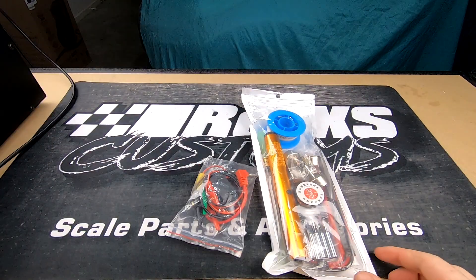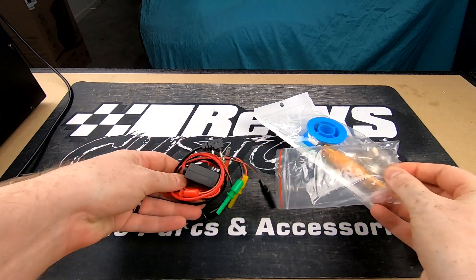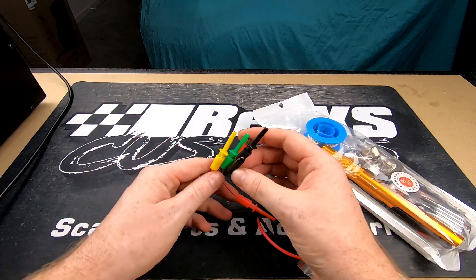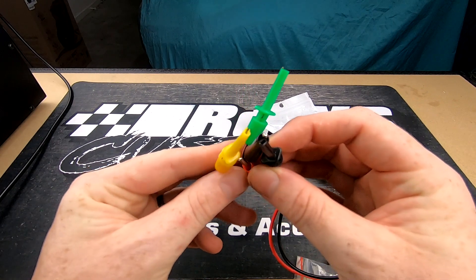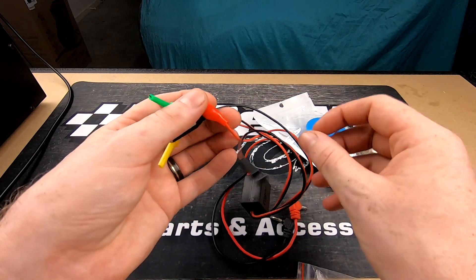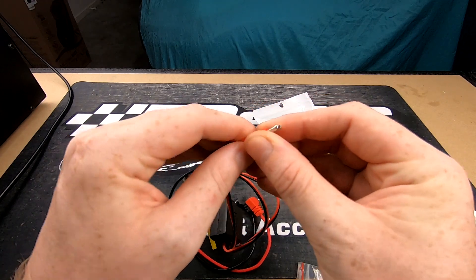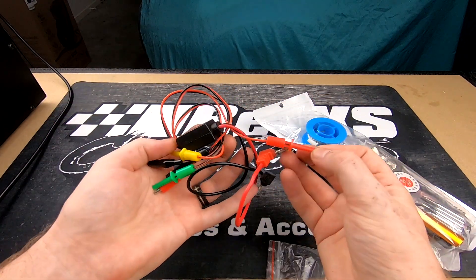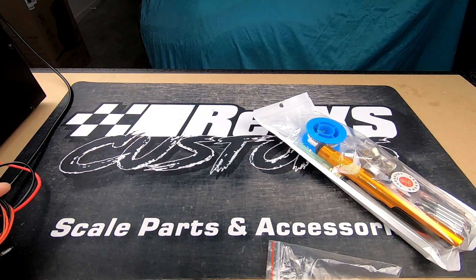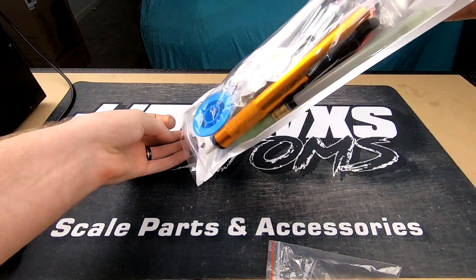So let's get on to some of the accessories. In this bag you're going to get all different leads for your power supply. A lot of this stuff, like these small ones, are going to be designed for testing components on phones — that's more what it's aimed for. You've got a couple of crocodile clips, handy for testing whatever LED circuits you'll make up for cars or whatever. It just plugs straight into your machine and then you set whatever voltage you want, up to 15 volts at 2 amps.